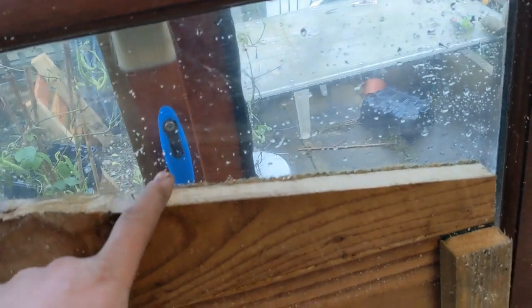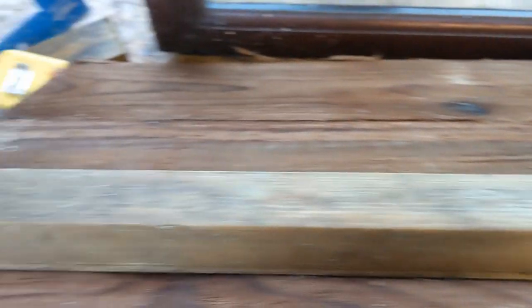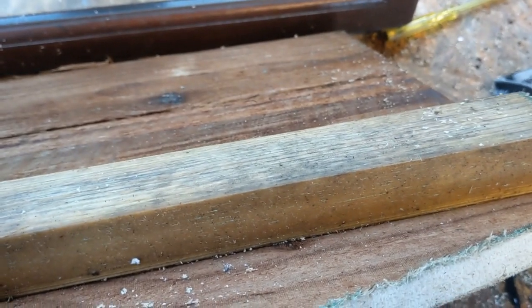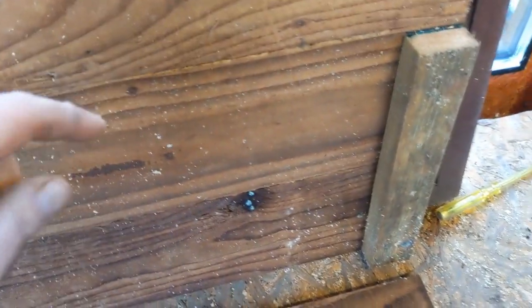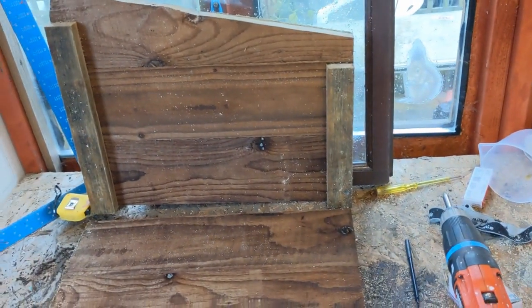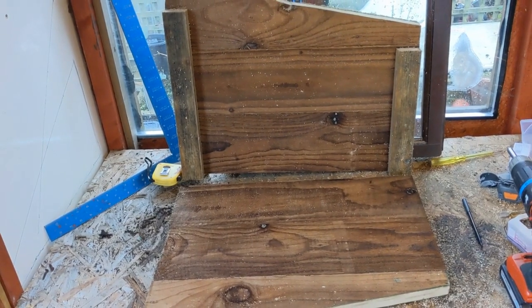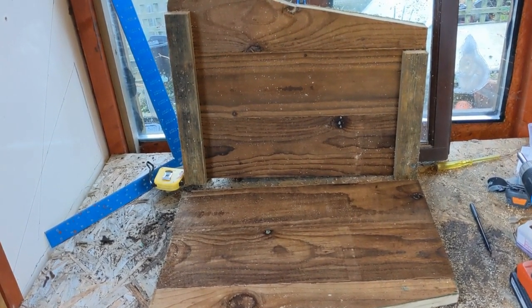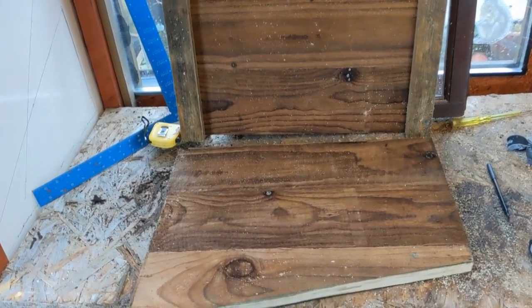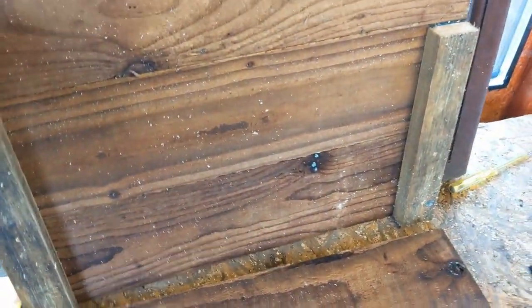In order to make sure that top piece of wood lines up and is fixed, I've put some two-by-one on the outside, equidistant both sides of the planks and screwed in. You can't even see the screws — they've sunk into the wood because the wood's damp. But if you weren't 100% sure before making that fixing, you'd have a devil of a job getting those screws back out again because they're buried within the heart of the wood.